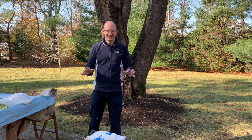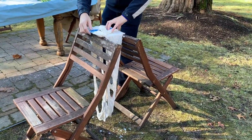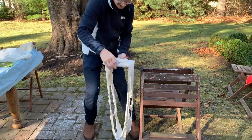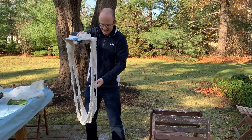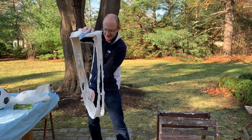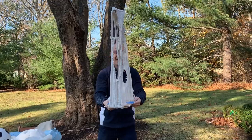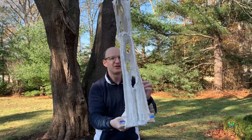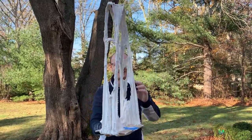Let's see if this works. This is the piece that's finally set. If you remember, it was just fabric — really just cheesecloth. Let's see if I can pull this out safely. It's set. So it's all hanging in tension — the cloth was in tension, and this is still in tension. What we're going to try and see is if in one go I can make this change into compression. And that's how you make fabric go into compression: we started with the right shape in tension, then made it solid, froze it. And there we go — check that out.